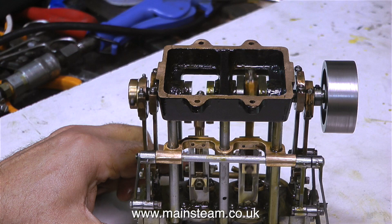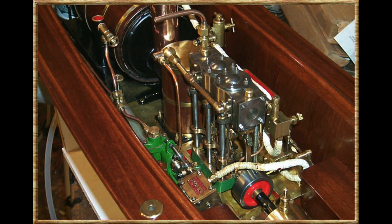This was only at the beginning of the run. In no time at all the boiler pressure dropped and the engine was very weak, hardly running at all. I fitted a five-inch diameter, quite long water-tube boiler fired by a blowtorch nozzle — it got very hot in there, but a ceramic burner came nowhere near and could not provide enough steam to successfully run this engine.